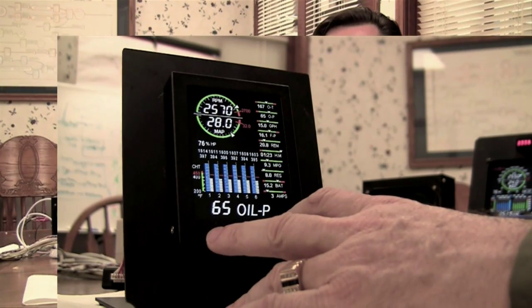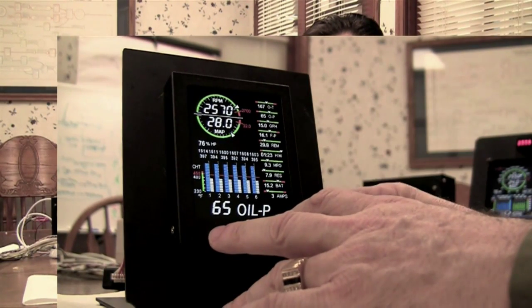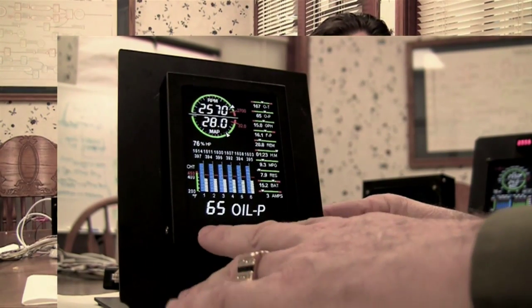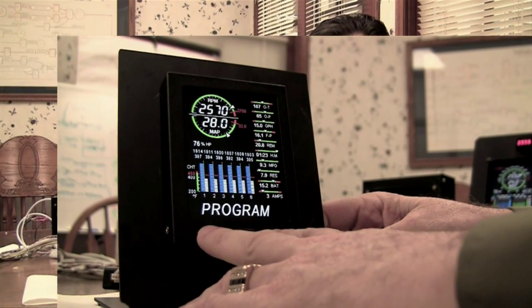The EDM 730 is really an instrument that contains the core features of the JPI product line: exhaust gas temperature, leaning algorithms, cylinder head temperature. And it takes it a step further, though, in as much as it provides RPM, manifold pressure, oil temperature, TIT, compressor discharge temperature, carburetor air temperature, outside air temperature, fuel flow, fuel remaining, fuel computer parameters. It handshakes with your GPS. And does all of that in an extremely compact format that fits in a 3 1/8 inch hole.